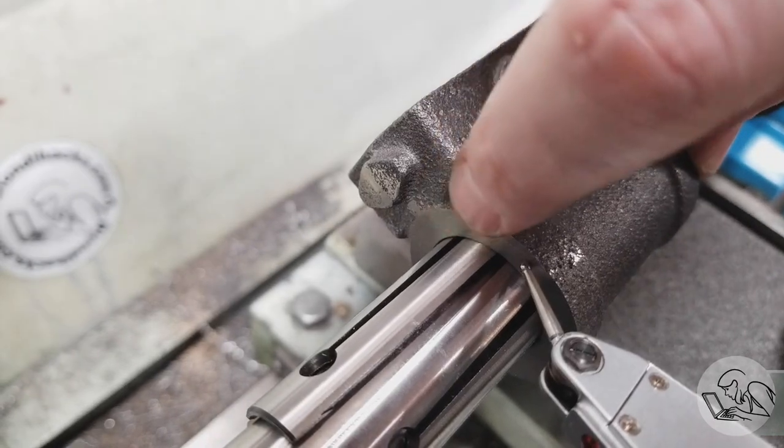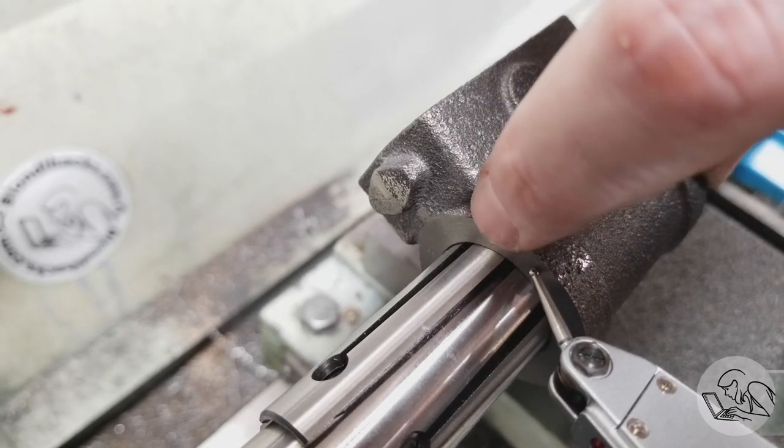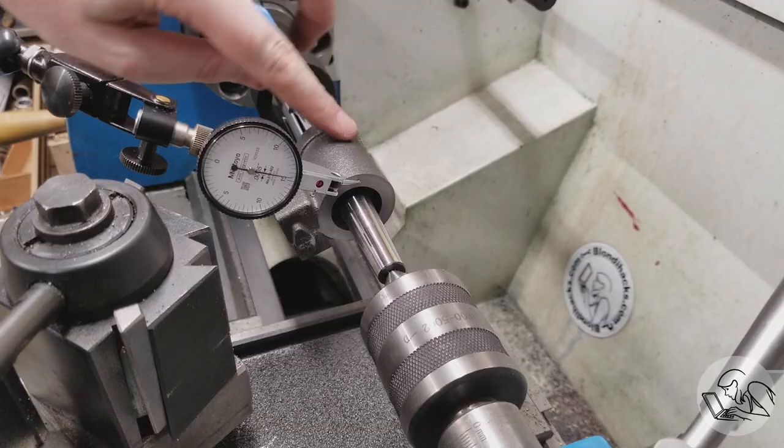But we're not out of the woods yet. The other end is the one that was supposed to be the frame mounting end, and that was faced second, so it's known to be running out quite a bit — about eight thou of runout. The problem is this is the end that mounts on the frame and sets the relationship between the bore axis and the engine axis. If this cylinder is mounted eight thou off, the bore is crooked by eight thou, which is going to affect how well the piston runs in there. My plan was to face off this end now, but I don't have room — the cylinder is already flush with the steam chest. There's literally nowhere to go here.